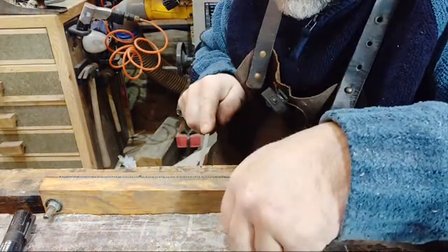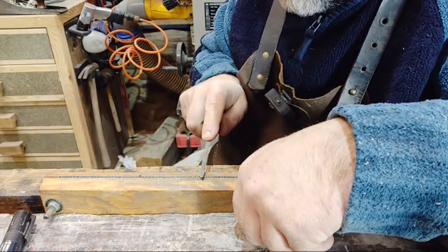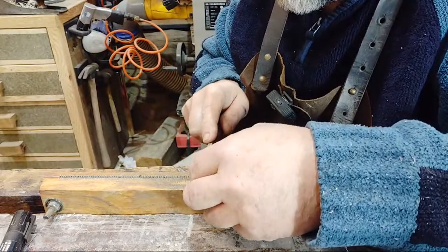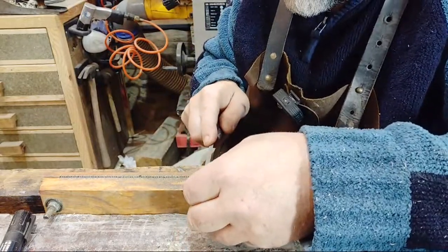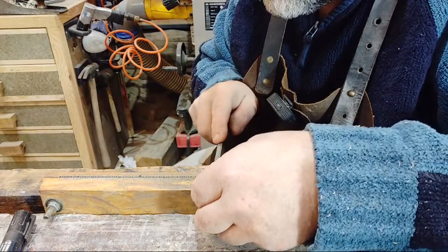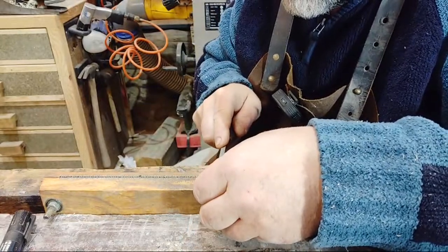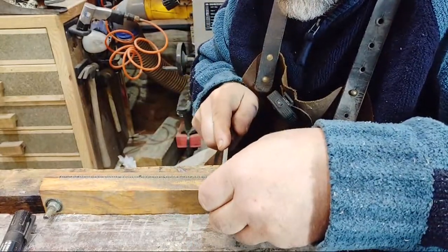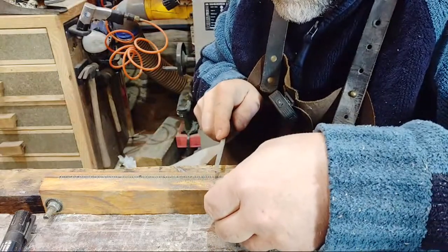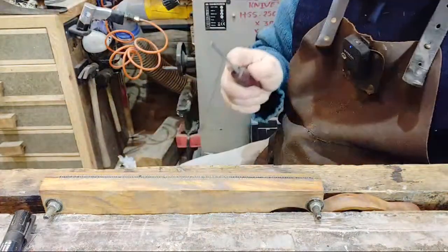I'm using that line here that I've made into the piece of wood with the file as my guide that I've missed a tooth. If I'm here, I won't see that line, that'd be gone, be hidden by the file. But because I can just about see the line and the angle I'm at the back edge, it's okay, it's good. Teeth on edge. That one, miss a tooth, it's that one. Oh, I can move my chair again. There's wheels on this chair.